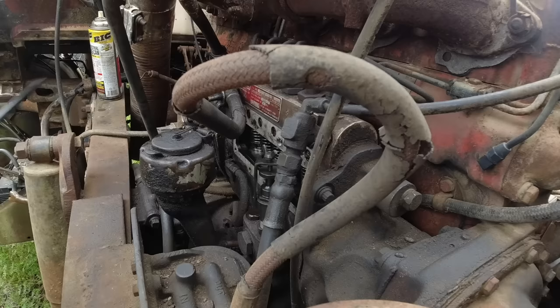Like I said earlier, the only thing I'm concerned about is are we bottom dead center or top dead center? You know what I mean? Because you get a 1 in 2 chance of getting it right, because that crankshaft turns twice for every time that pump turns, because you're not injecting fuel on the exhaust stroke. How could you possibly use that and know?